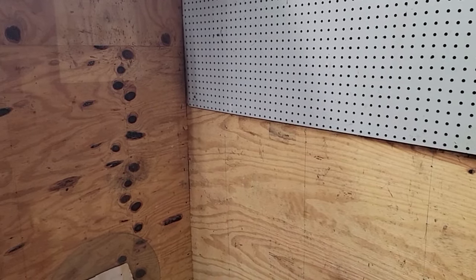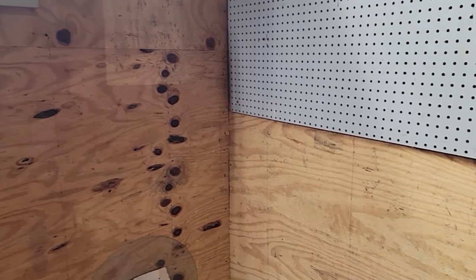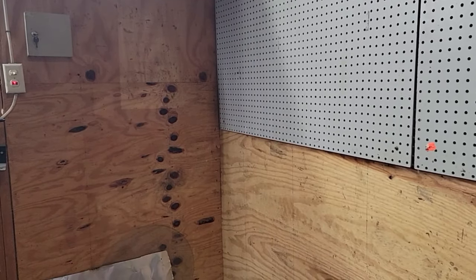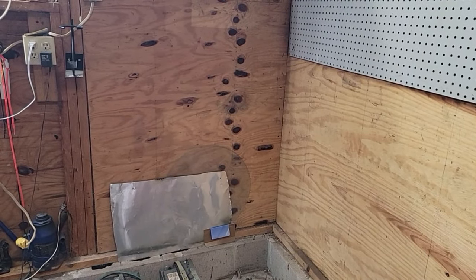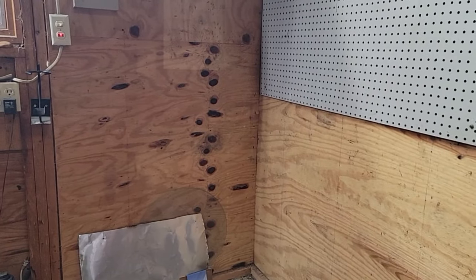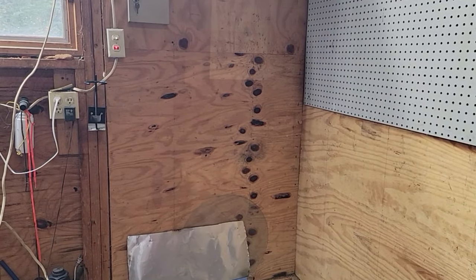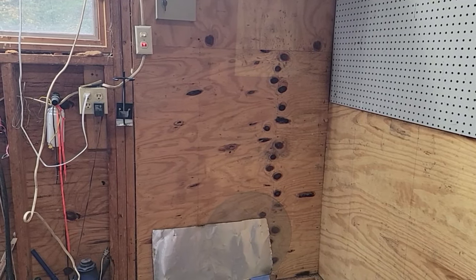In that case, I could just put drywall over it. I want a fireproof surface — probably two layers of 5/8 fire code drywall around the wood stove area. The setback has to be minimum two inches clearance from a combustible. The stove itself has numbers on the back like 12 inches from the wall. I think I'll do a metal backing on it anyway, because I always worry about fire. We want to put this in safe — we've got to go by code. The distances are important.